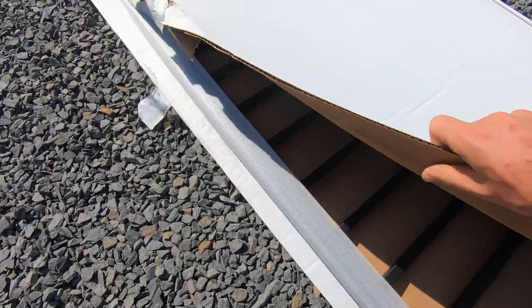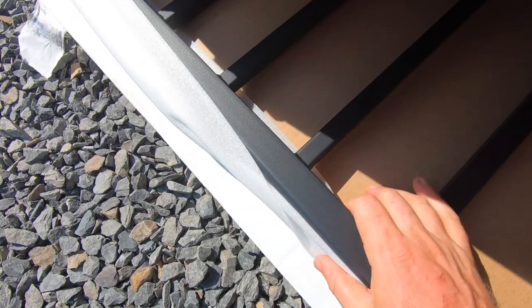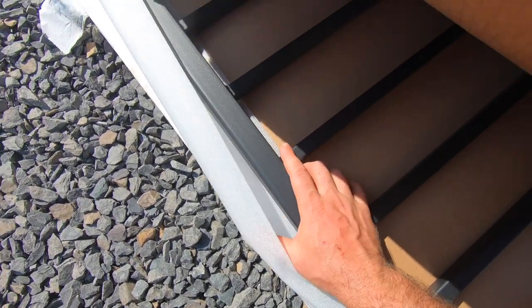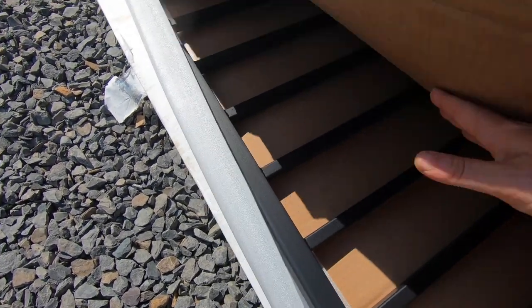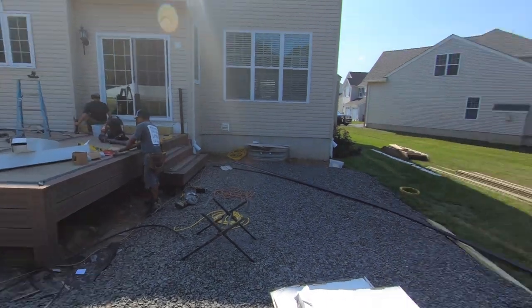I was never a believer of these. We used to always use 4x4 posts and have carriage bolts through them, but this is actually a lot stronger than that — I don't really know how, but it's amazing. And you can put down all your decking first so it goes in way faster, which I love. So we're gonna get these installed, then start cutting our sections. The sections are right here — and not only are they pre-assembled, they're welded. Super easy to install because everything's already put together. There's no chance of a rattle because they're welded together, which is amazing.